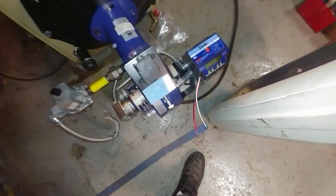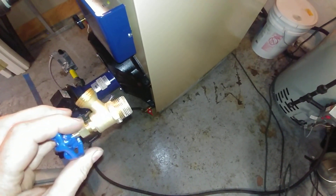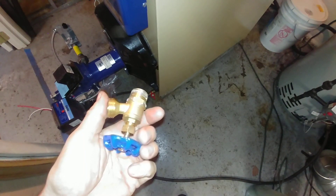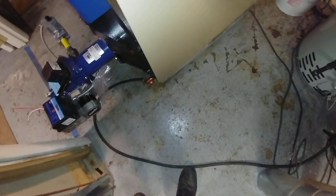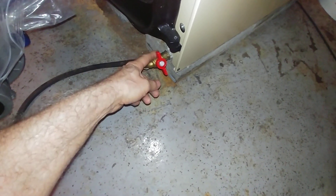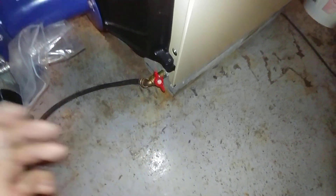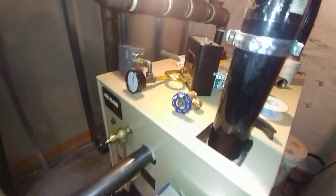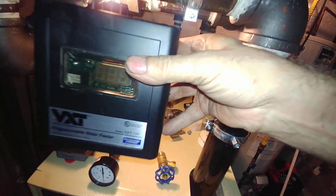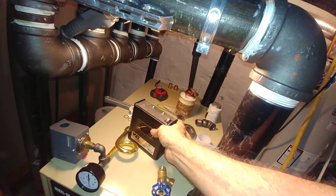There's a whole other topic to cover on the burner — I'll come back to that later. This is the drain valve that is usually supplied with this boiler, and this is going right into the scrap bin. We substitute quarter-turn ball valves, which have enough clearance for the door to open and shut, yet provide good flow when you open them up. Out in front here is where we're thinking about mounting the VXT — I'm not exactly certain whether it's going up here or up here yet, and that is going to be today's fun.